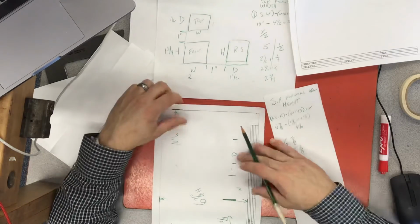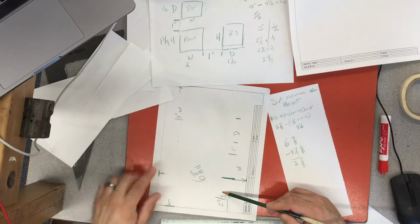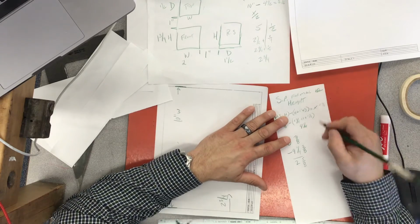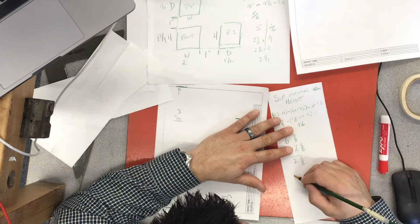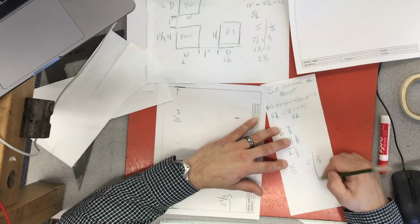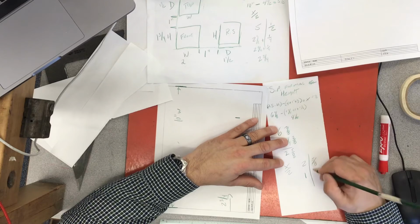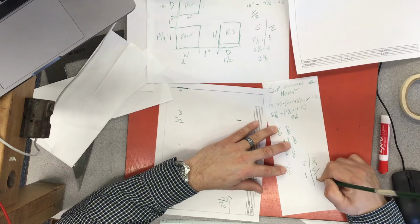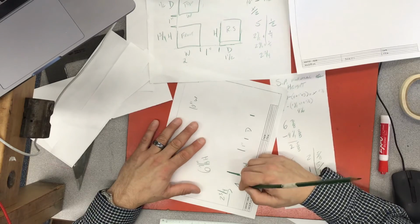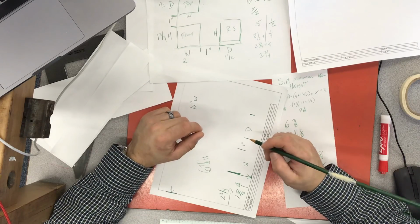But that's going to be the distance if you went from the bottom of your drawing space. If you went up 2 5/8, your drawing would end right on the top of the title block. So we want to split 2 5/8 in half. 2 5/8 is x. We want to take x and divide it by 2. What I like to do is I split them in half. We know that half of 2 is 1. We know that half of 5/8, well, if you can't figure that out easily, leave the top number alone, 5, and double the bottom number, 16. 1 plus 5/16 is 1 5/16. So your start point up should be 1 5/16. And that is how you find the start point for a drawing. All right?